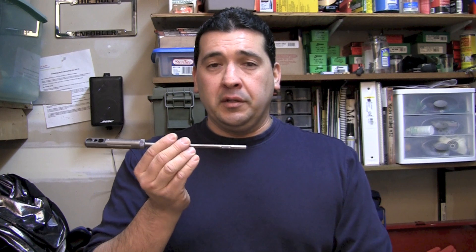Hello again, this is Tony and today we're going to talk about the flash suppressor alignment gauge. A lot of people call it a tool and have the misconception that a flash suppressor alignment tool is needed to properly align the flash suppressor. It's not true. The flash suppressor, once it's screwed on to the end of the barrel, rests how it wants to rest. The proper terminology is a gauge, and what it does is tell you if there is a misalignment or a gross misalignment between the flash suppressor and the barrel itself.